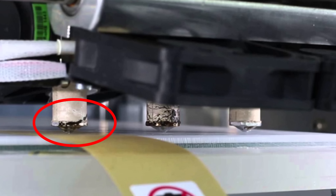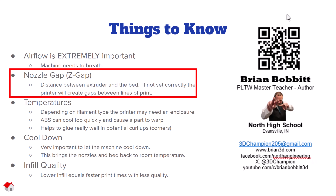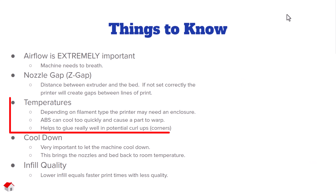You can see in the picture to the right that the nozzle has a little gauge to it — basically the equivalent of a piece of paper. If we take a piece of paper and put it between the nozzle and the bed, there should be a slight grab to it. When using PEI sheets, I liken it more to a playing card, or sometimes even a business card.